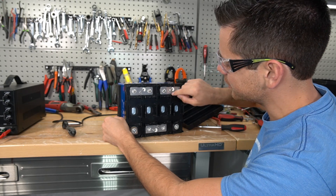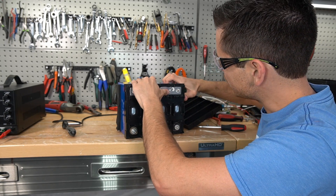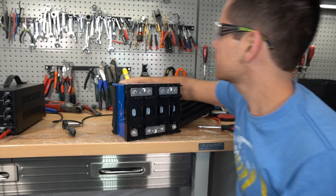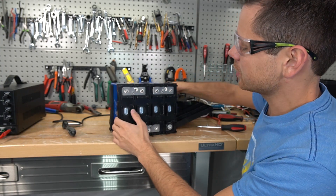There are actually two heater pads — how did I miss that? These are 6 volt pads in series, pretty simple configuration. The heat sink has fiberboard and it's not touching the cells — it's connected to the cell holders. This is not as bad as I was expecting. Let's see if these cells are new. I don't want to cut the wrapping with my tool in case I nick the cells, and I really don't want to deal with electrolyte. These bus bars are just aluminum, so let's snip one to check.